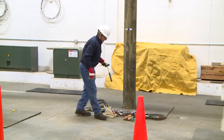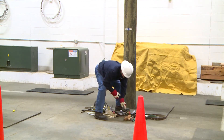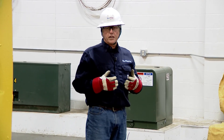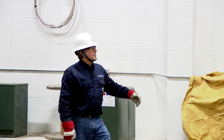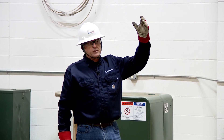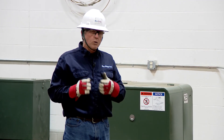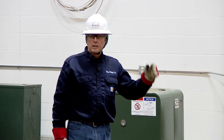Next I discuss the job plan. All co-workers must have required PPE on and self-check. My plan is to tool up, climb up on the back side, transition over the neutral, go up about three steps, transition back down over the neutral, come down about 10 feet, circle left, circle right. Then I'll demonstrate how the super squeeze will restrict a fall — it won't prevent it, but it will restrict it to a minimum of about two feet if properly used. Then I'll come to the ground.